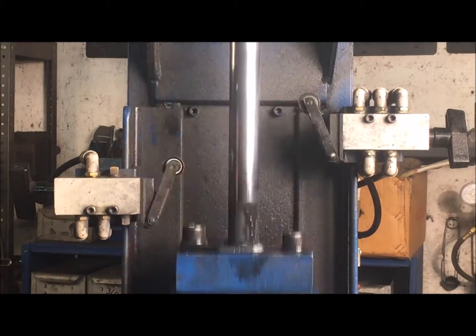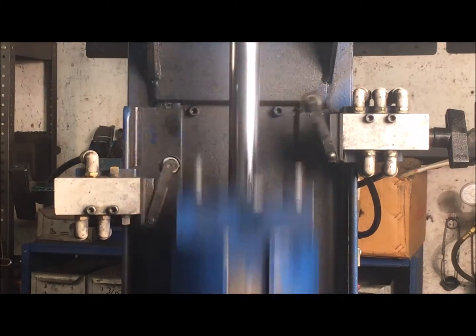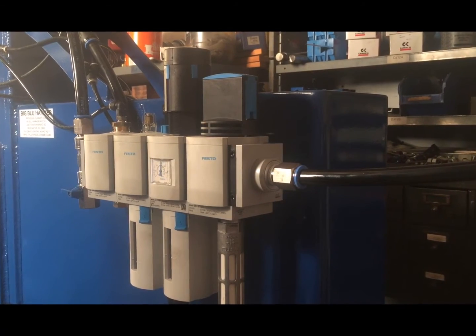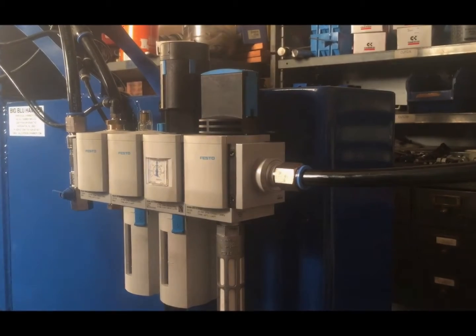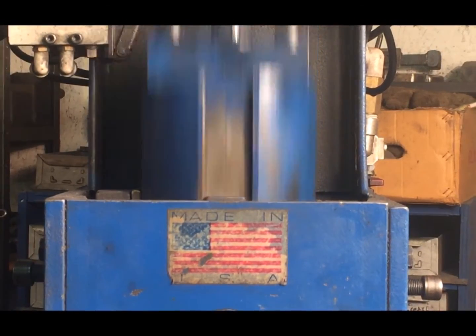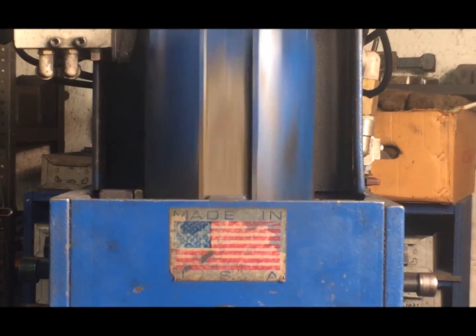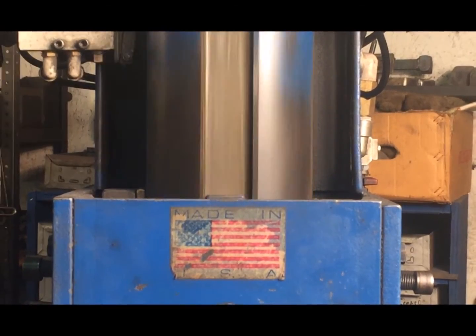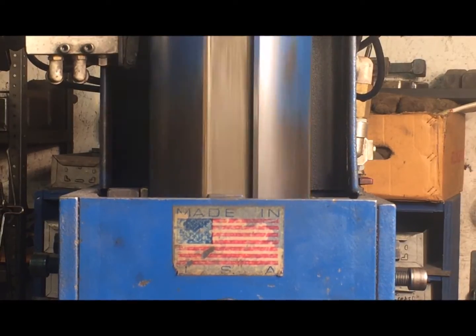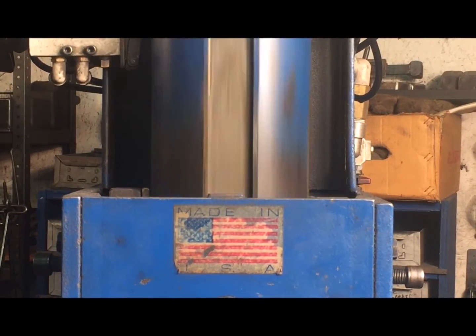This means if your hammer ever starts losing those attributes, then you need not look any further than the few parts we mentioned. We recommend if you have any trouble with your hammer, you check the alignment of the mini valves first. If you haven't done this before, you can find the link in the description below. If you have checked the alignment of the mini valves and they are in line but the hammer still isn't running correctly, then the next place to look is the 5-way valve.